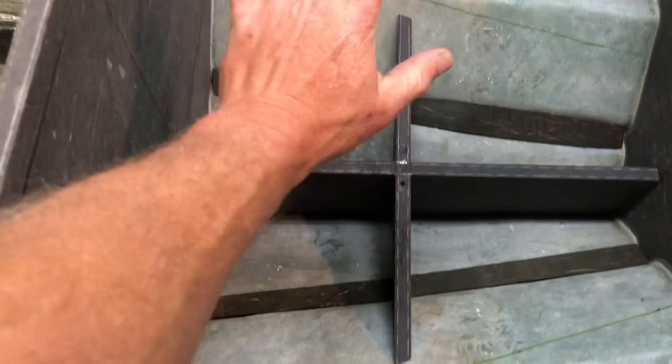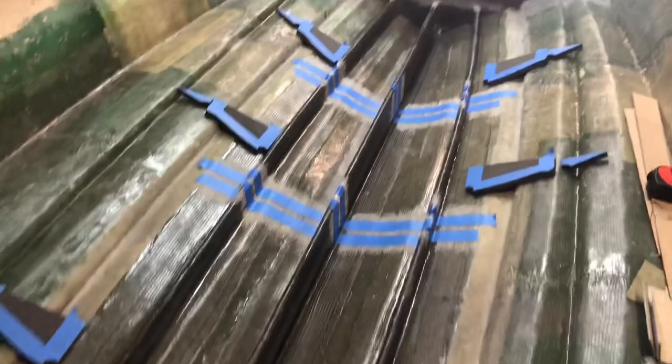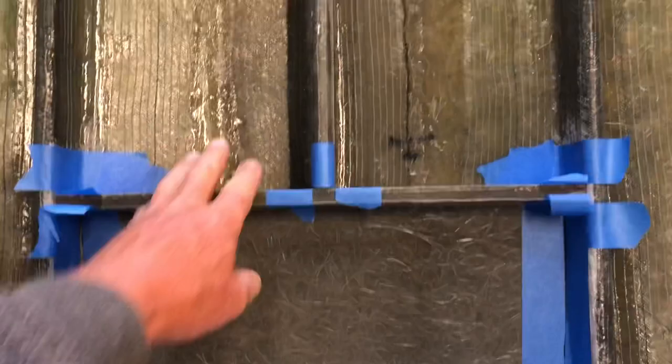Here's that drop-down section for the bilge area. The drain plug is drilled through now. I've got all of the hull prepped up to glue in these bits and pieces. I'll glue them in now — glued all this in yesterday. So I've just got to give all this surface another sand, and then I can laminate that in.